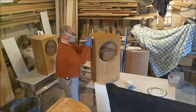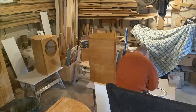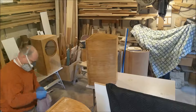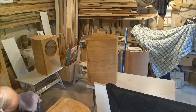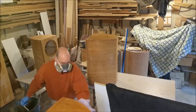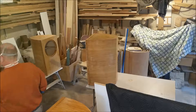Here we go — cleanup. I'm making sure there are no little bits of dust or soap, because it's soapy water that's used as a lubricant for wet sanding. I'm walking around and wiping all the way around with a rag dampened with mineral spirits or paint thinner. That overgrown toothbrush is for cleaning out little crevices, because when you're wet sanding you make up a slurry of varnish particles and it tends to stick in those little cracks.